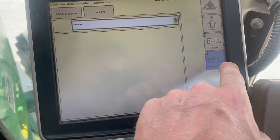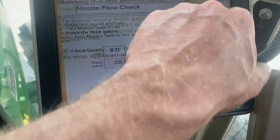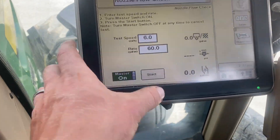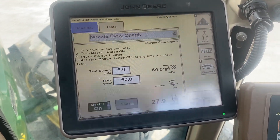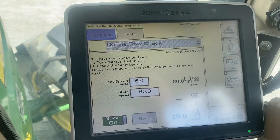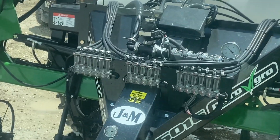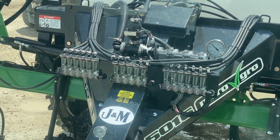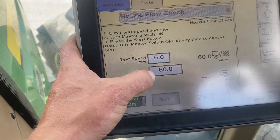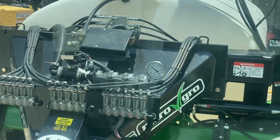From here, what I like to have you do is go to diagnostics, do a nozzle flow check, put in a test speed and your target rate, and click go. I'm doing all of this with the pump engaged — the pump has been engaged the whole time but only running when told. Now we look and we're spitting product. Basically we're pretending we're in the field — this applicator is applying 60 gallons per acre at 6 miles an hour right now, and our psi is perfect at 30.